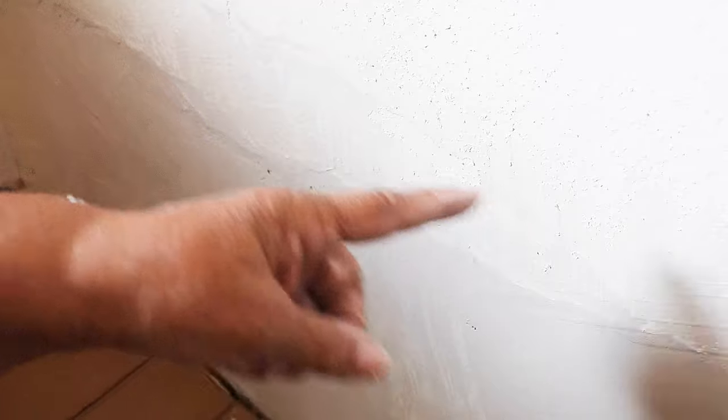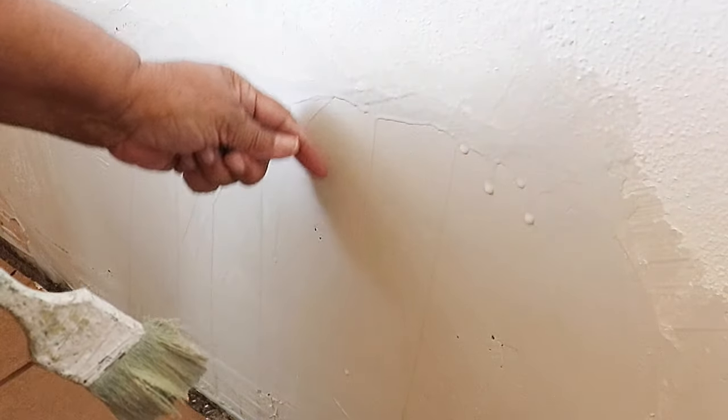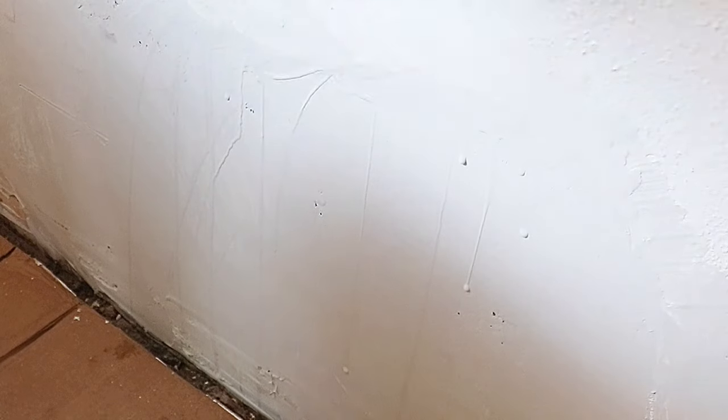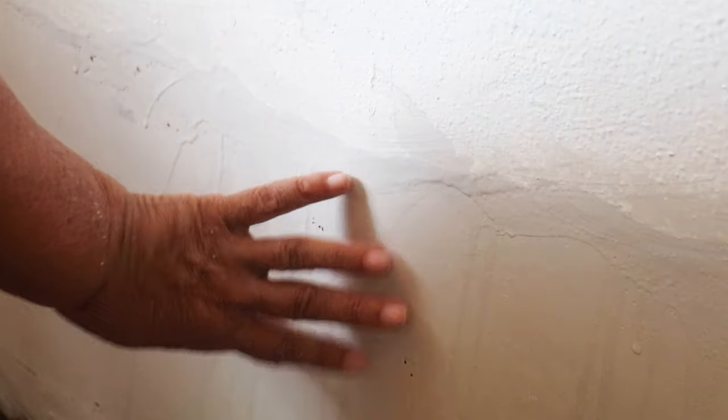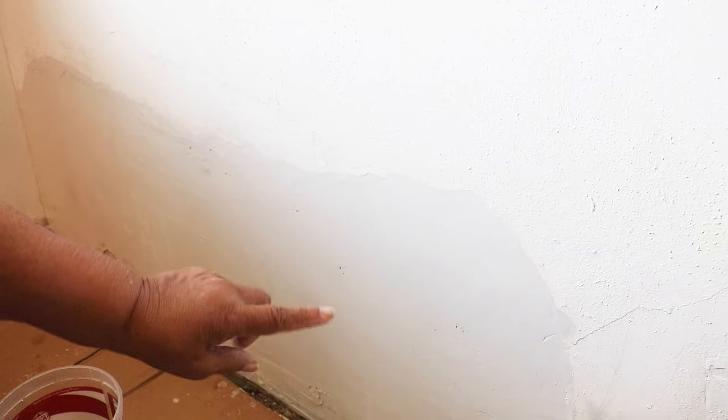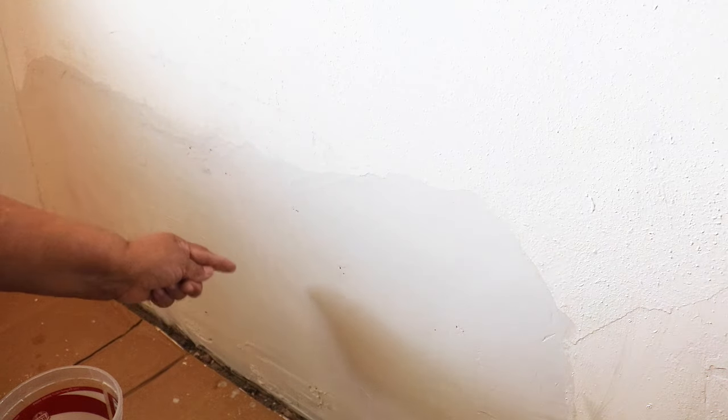I've got my scratch coat on here. I'll let the plaster sit for maybe five to ten minutes, then I'll start to clean my edges off a little bit, then I'll apply a second coat. What I'm doing here is wiping it down with water, and what that will create is a nice smooth transition from the new plaster to the old. I want to get rid of all those hard edges — just use your brush and your water to do that. I'm not worried about the body of the patch; I'm just concerned with getting my edges. We'll take care of the imperfections when I apply my second coat.